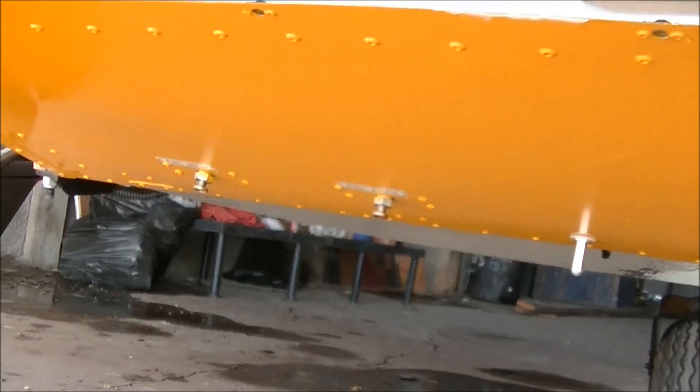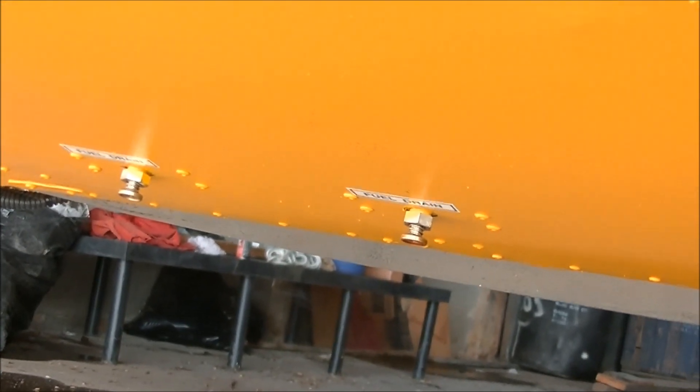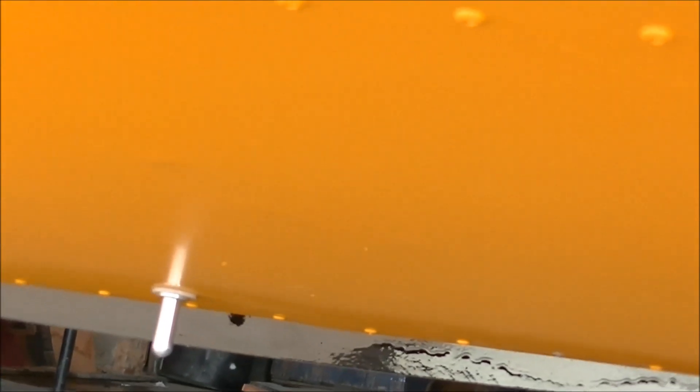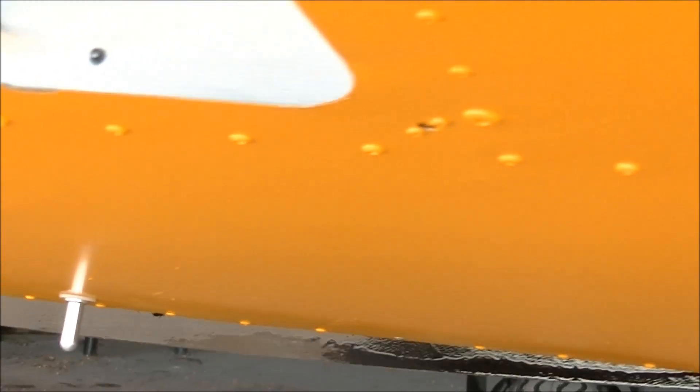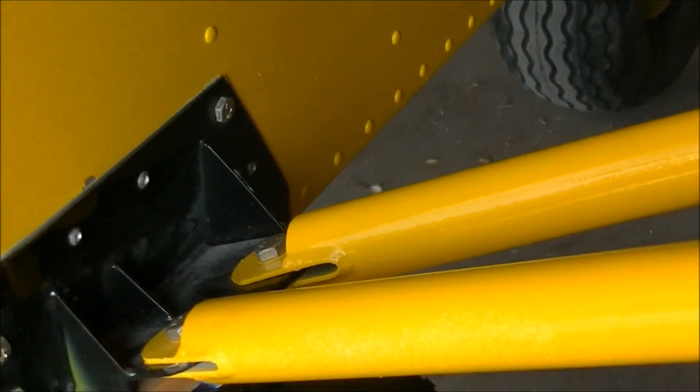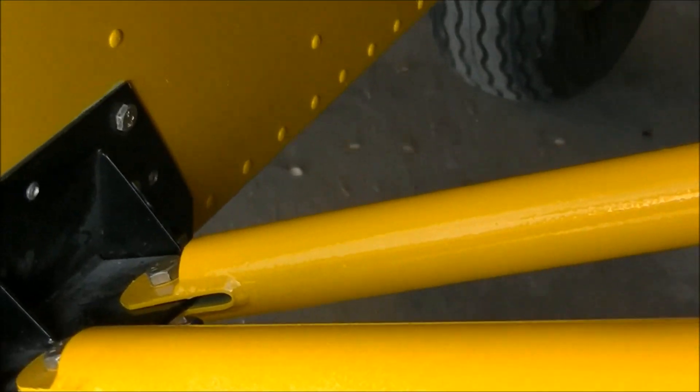Down below he's got the quick drains for the inboard and outboard tanks, and he has an outside temperature probe. We'll check the gear on this side too to make sure it's not loose — put your foot on the wheel, hand on the strut, and try to rock it. Looks good.